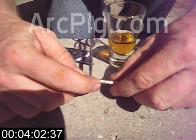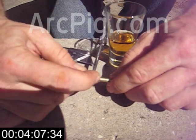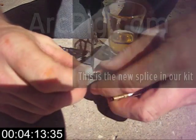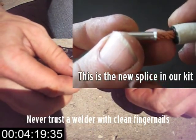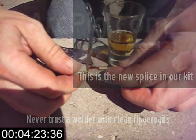The second crimp is not difficult, although rounding up all the copper hairs was so annoying that after I filmed this, I went back and changed our parts kit. Now we use a butt splice with slightly flared ends — it slides on much easier. Just be sure you squish the flared ends so that they don't obstruct the water flow too much.